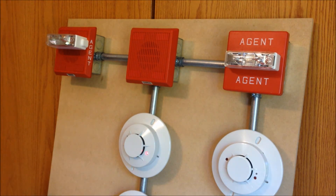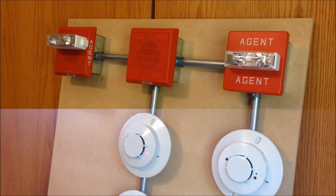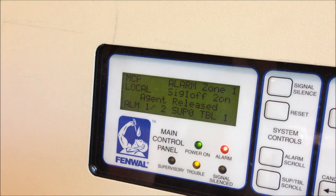So now the two horns have been silenced. You can see that the strobes are still activated because these are non-silenceable while the agent is releasing. You can also still hear the panel buzzer. The agent will continue releasing — this is only a demonstration — but we'll be releasing for 90 seconds. During that time, I can't silence the panel's buzzer and I can't cancel these two strobes. Down here you can see on the screen the release cycle is still continuing. We have the signal one circuit off, which is the horns, and you can see the signal two circuit is still on, which is why the strobes are still flashing.